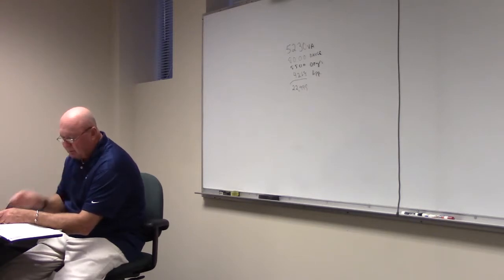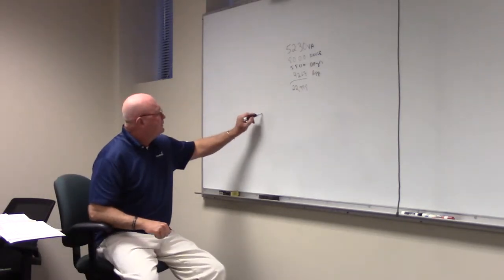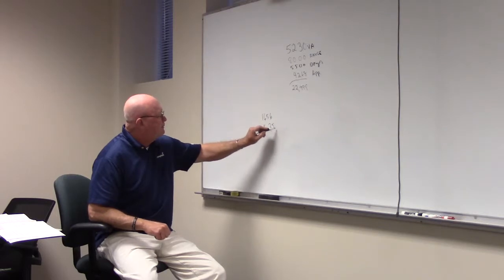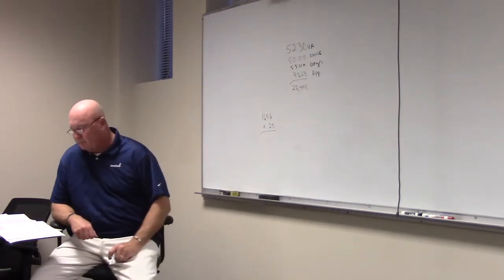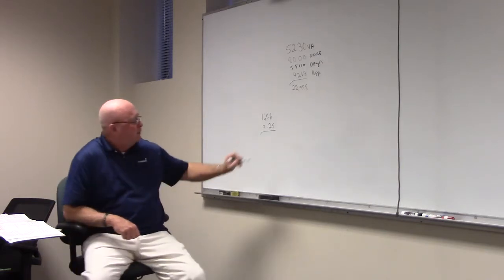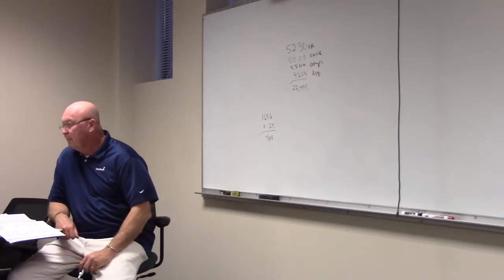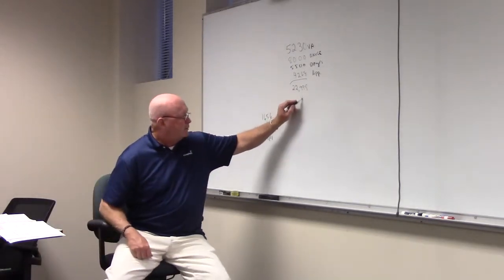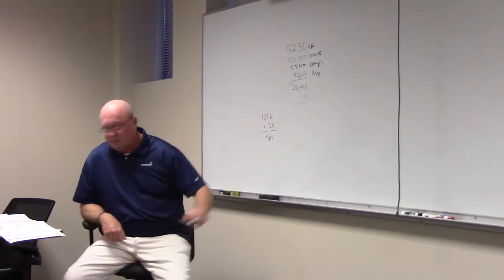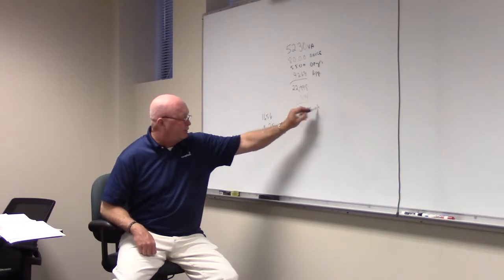Yes. And so then that becomes 1656 times 25%. 1656 times 25%, how much is that equal to? 414. What are we going to do with that 414? Add it to the 22. Add it to this. And how much do we get? 23,412 volt amps, right? Yes.